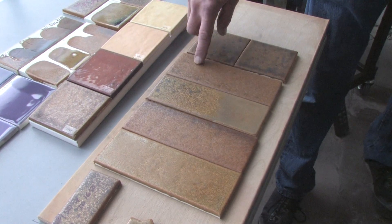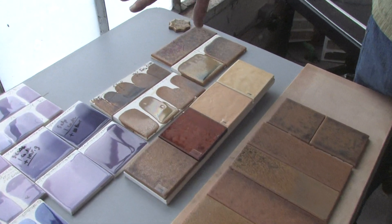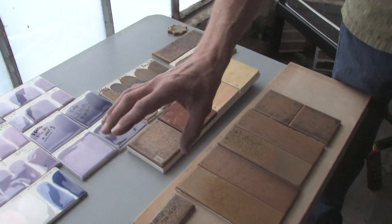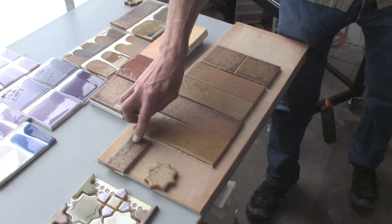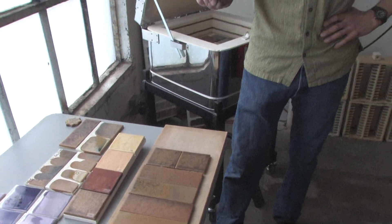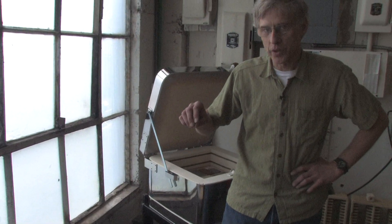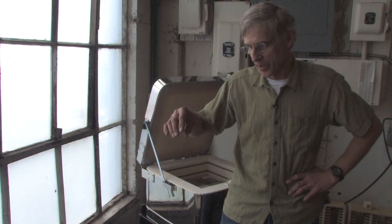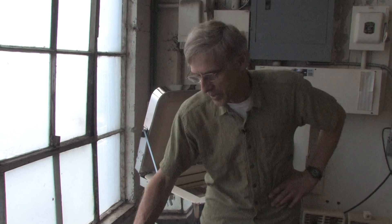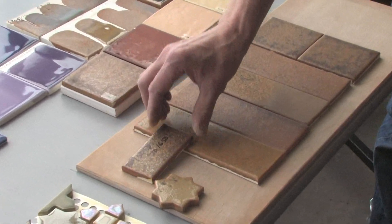This is all the same glaze. After trying some chemical changes — adjusting the glaze with different amounts of zinc and titanium — we discovered that we can use the original formula and get back to where we want it to be. It took a little testing, but using the Glazetech kiln, I discovered that the right program for this glaze, at least this batch, was a cooling rate from the top end at 150 degrees an hour down to 1650 degrees, with a half-hour soak after that. So the same bucket of glaze can be made to come out correctly with the right cooling rate.